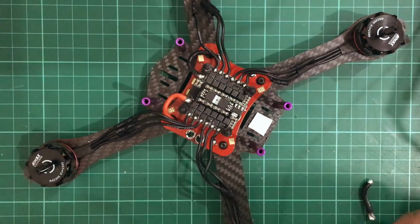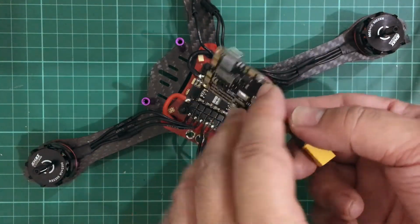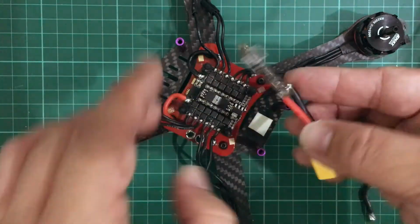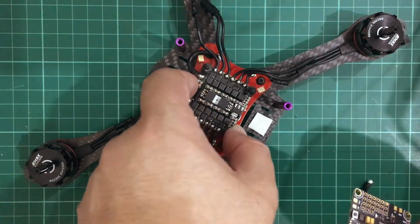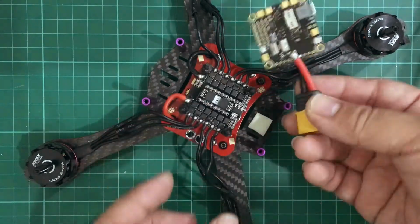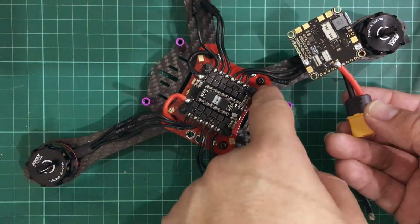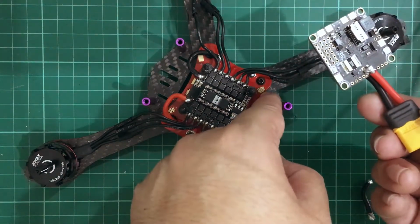However, with this Betaflight F3 board, now the positive and negative terminals that are supposed to go to your ESCs are scattered all across the board, and I didn't have an ideal port that I could use. Maybe I could use these two, positive and negative, and pad it to a corner, so at least I still don't have to remove my 4-in-1 every time I remove my flight controller. Or at least if it's shrouded here, when I remove my flight controller, I could just flip it on the side. So that might be a solution. Another solution might be to just go directly to the ESC. I'm still thinking about it, but let's try padding it, wiring it to these corner pads. So at least we'll have one positive and negative here, which connects to the positive and negative over there.